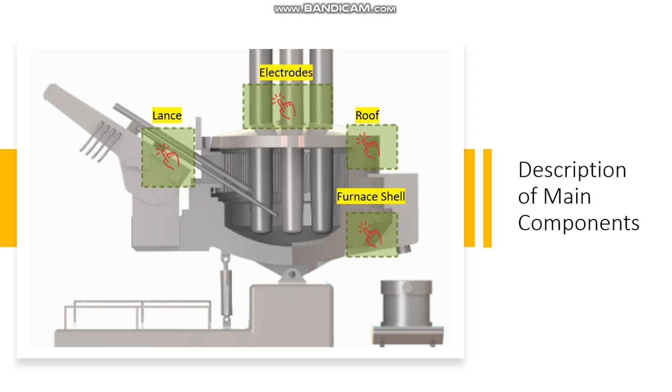For the roof, on the upper side walls and on the inside of the roof, water-cooled elements are used instead of ceramic insulation. These water-cooled panels are positioned so there will be no direct contact with the liquid steel. Finally, the furnace shell: the basic setup of an electric arc furnace consists of a furnace shell with a roof on top, lined with ceramic bricks insulating the furnace from the liquid steel.